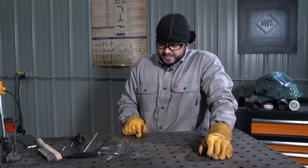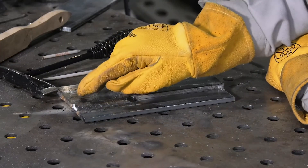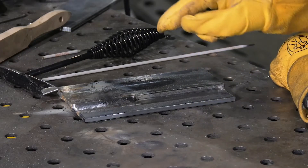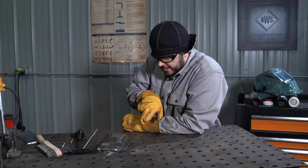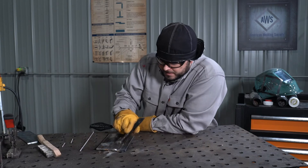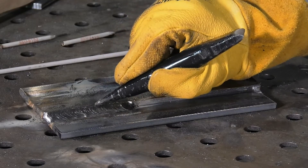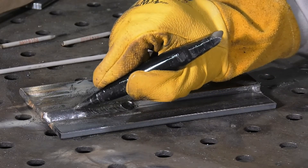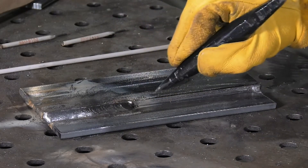The lap weld with E7018. What we're looking for in a good weld is a nice tie-in from the top plate down to the bottom plate, a convex profile. We want to make sure that the weld bead is centered in the joint root, ensuring we're getting penetration and tying in these two pieces of metal. One thing I would have liked to do a little bit better on this one is maybe hesitated a little bit longer to get a smoother transition along that top edge. As you can see, there's just a little bit of maybe undercut showing here. Slow down, correct your work and travel angle, and that should go away.